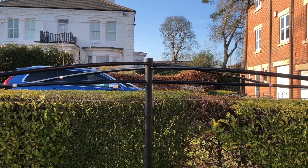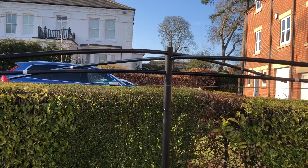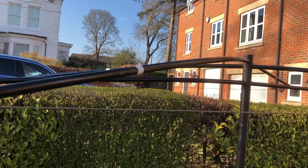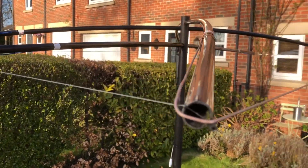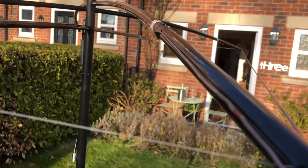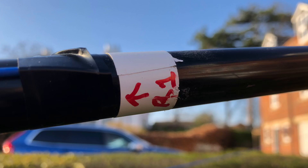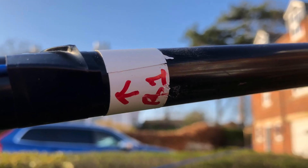In this general walk-around shot you can see one of the elements folded around the end of one of the four spiders. The brown wire is wrapped around the end and taped onto the arm of the spider. Once you've finished the build, if you mark on the end of the spiders where the wire goes, you know where to tape it up each time you construct it.